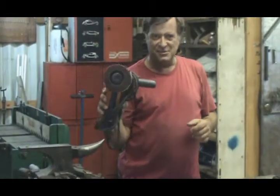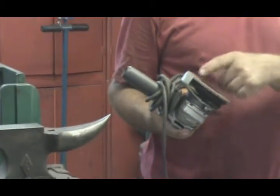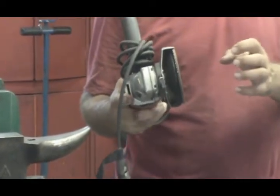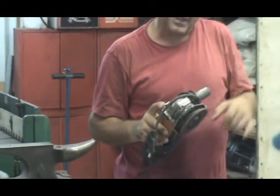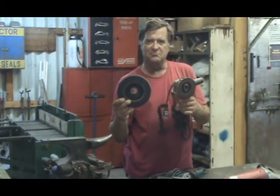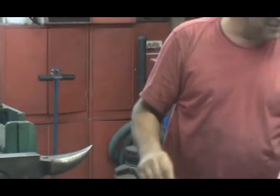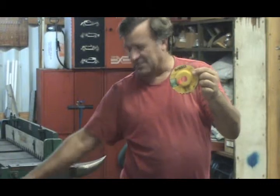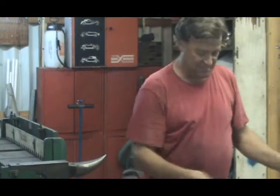It's a little one-handed job. I use this one one-handed for doing detail work. With the different types of flex pads you can put on here, different grits of pads — you can put a real heavy grit on it and get a lot of work done. You can go to the lighter grits where you can smooth out all the little grind marks and make it all bright and shiny. You can even get masonry pads for grinding off a piece of concrete, smoothing off a seam, or metal pads. Very versatile.